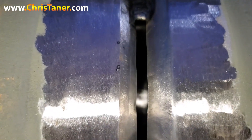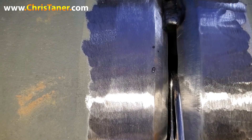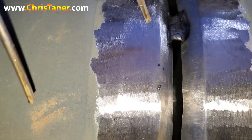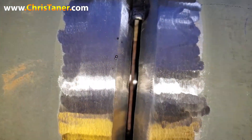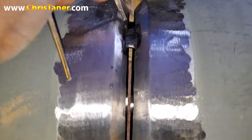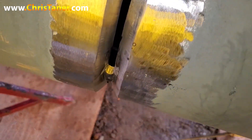You can notice this is a wide gap. Like I said, this is a 5/32 wire — quarter-inch gap. It really don't matter. You use a low heat and it all works the same, between the feather edge, this end, that end.